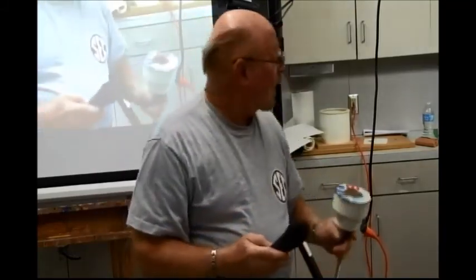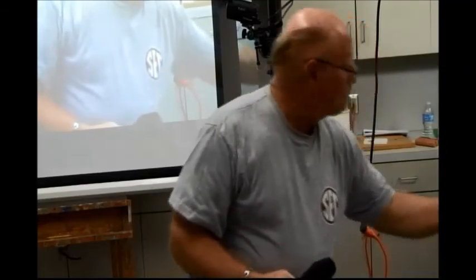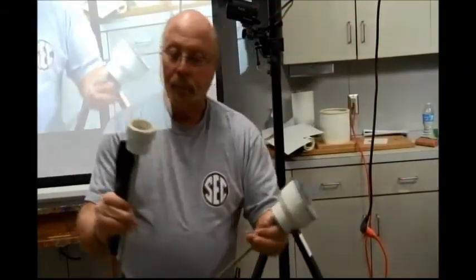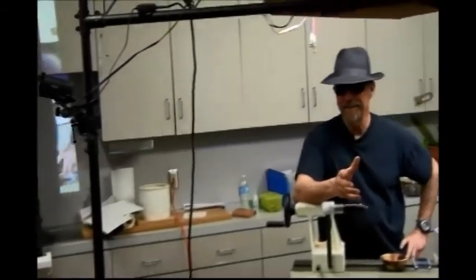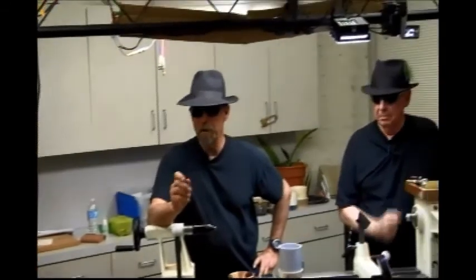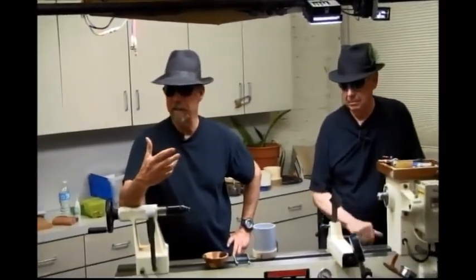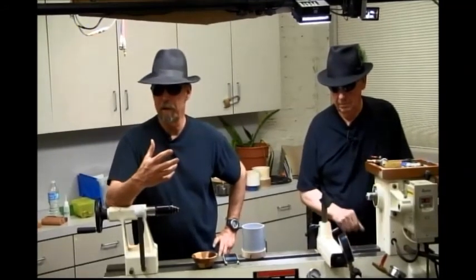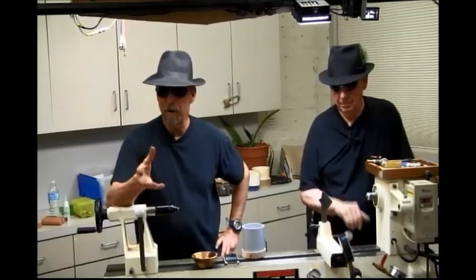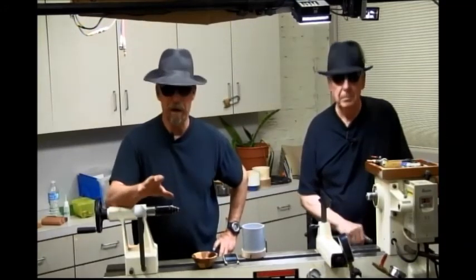One other thing I just say, because I know I did it, if you have a bowl on there and you've got it under vacuum, and you still want to put some finish on it on the outside, and it's a thin bowl and you're putting it on end grain, when you take it off, all that finish you did very nicely on the inside will have that finish with it, and you'll have to start over again, because not all of it, but all finish will come through the bowl and come into the inside that you already finished. Don't do that.